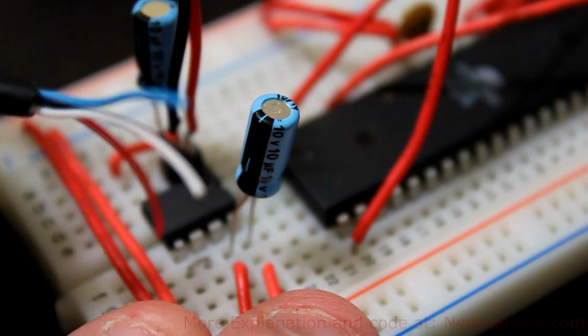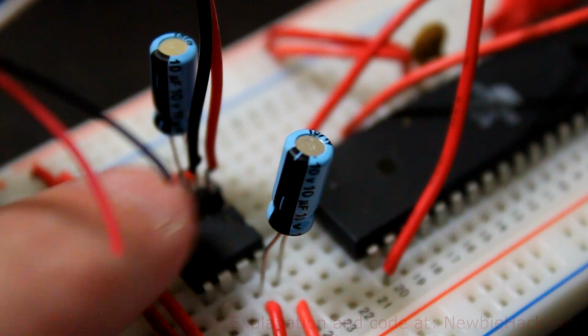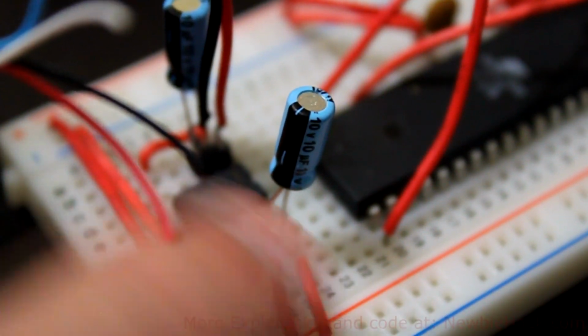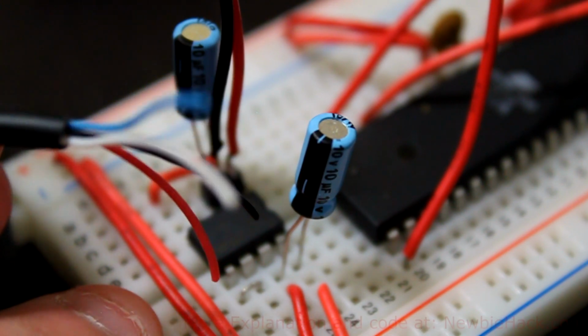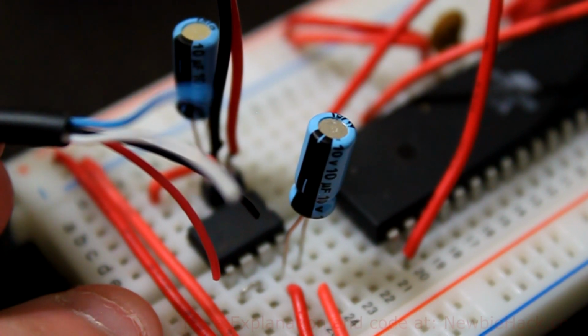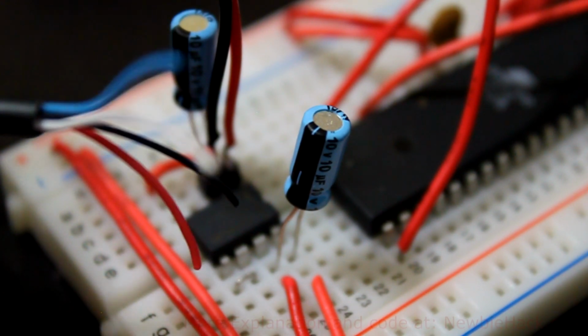And you would need to plug this straight into your circuit without using a regulator, because the computer has a pretty good regulation of voltage coming out of it. But putting 5 volts into a circuit like this, you wouldn't be able to get 5 volts out, because you'd have to have something higher than 5 volts. So you'd have to plug this right in. But you could plug this into a 3.3 volt regulator and have that 3.3 volts come out from the output of this regulator.